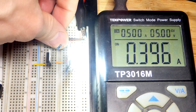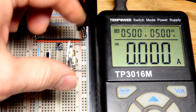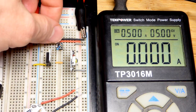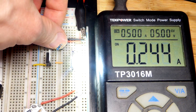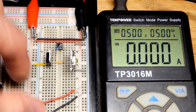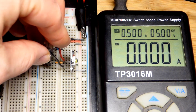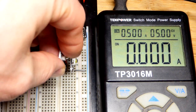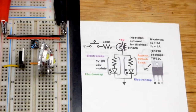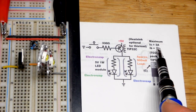There you can see we get about five volts across them and now I'm getting that higher current — it's kind of drastic. These haven't been lit very long but the heat sink does get warm if they've been lit for a while. We can just light one LED, or we could put more in parallel for more current. Even without a heat sink, since it's just switching on or off completely, you may be able to get close to the 3-amp collector current rating — though I'd probably stop at about an amp and a half.